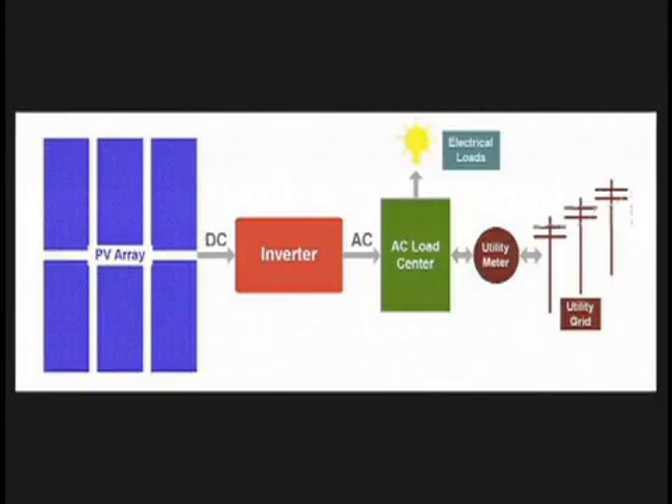This is the block diagram of the entire setup. The panels provide DC power from the sun and then go through an inverter, which converts it to AC power, which then gets fed into the load box — that is your circuit breaker box for the system. And then you also get power from the grid. People ask me: if the power from the grid goes down like a transformer blows up, do you still have power on a sunny day? No — because they automatically shut it off if the grid goes down, since they don't want you feeding your power into a grid where they don't know what's happening. You could electrocute some poor guy trying to work on a transformer.